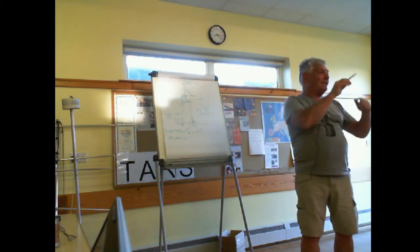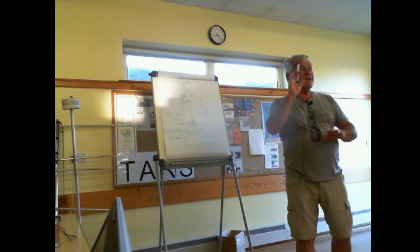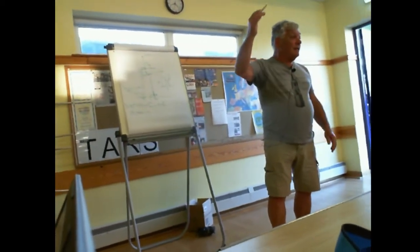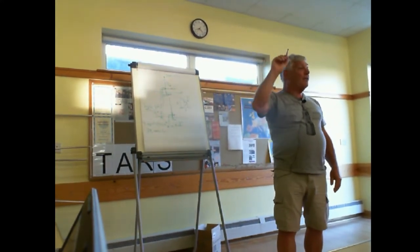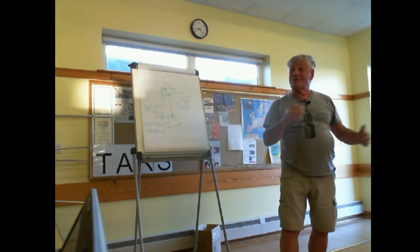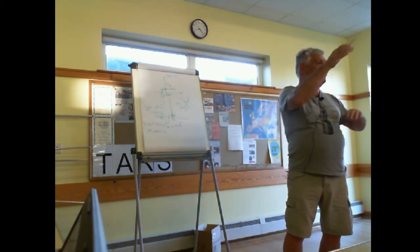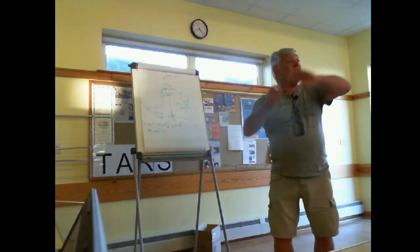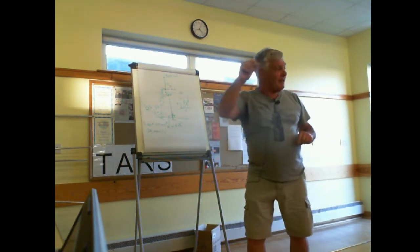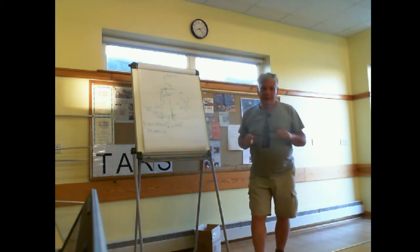So if you can actually do simple little sums, if you go and work it through yourselves at home in your spare time while you're trying to go to sleep, it's not an absolute, but you can work a lot of these things out in your head. 10 watts, 10 dBs, right? You drop down 3 dBs to 7 dBs, Ws. Well, that's got to be 5 because that's got half. And so it goes on. And you can do all these jiggery-pokery things in your own head by adding and taking away 3s, and you know you've got to halve it and double it and so on and so forth. So it's not as difficult as what it may initially appear. And then you can also use a calculator, but you've got to know that you've got to do 10 log this and 20 log that, depending on what you're working on. Enough of that.